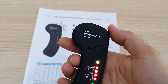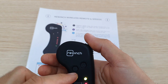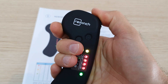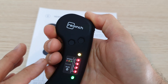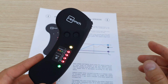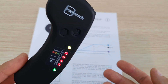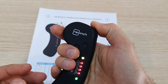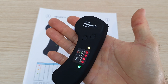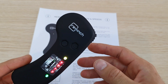Another advanced feature is cruise control. If you're in manual mode and want to hold a specific speed that isn't a preset value — for example, you're accelerating at 75% maximum and want to hold at a certain throttle position — just press the on/off button while holding that throttle and then release. The ReWinch will maintain that speed. Pressing any button will stop it. Note: cruise control has no automatic stop, so the operator must stay attentive.